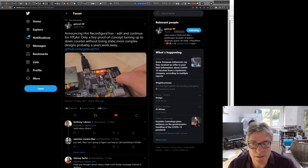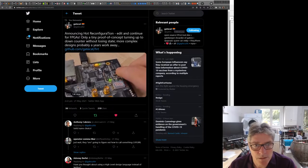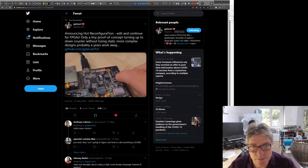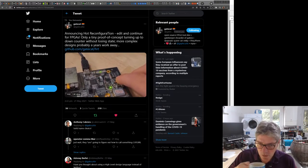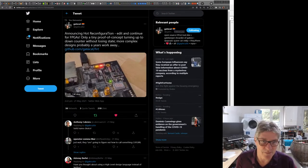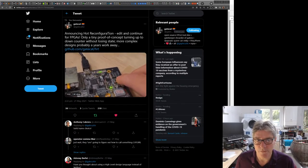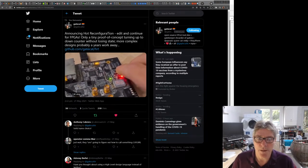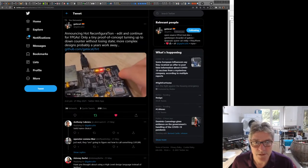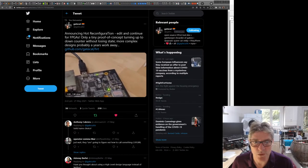And also via SPI or quad SPI or even DDR, double data rate SPI. On something like a Black Edge, for example. I'm sorry, on a Black Ice or Ice Core. So that gateware is quite important from that point of view, not just so that it can be programmed from UART, but also from SPI as well. So we need to look at how we can add that into the board support software.